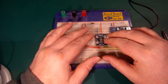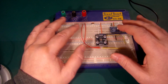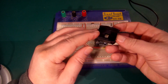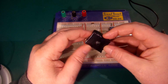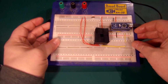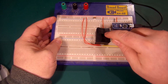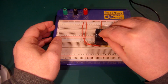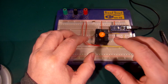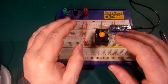Also, they're sensitive to ambient lighting, so even with these bright white LEDs, in a well-lit room or a slightly dimmer room, you can get different results. So to be a bit more consistent, I built this little shroud: a little black card, black sellotape, and a little gap in the middle, and that just slots over there. That blocks out any exterior light sources, different colours or shadows. And I've got a little narrow reading window, so I can pop the colour I'm sampling over the window, and it should only be sampling that colour. I think that's going to be suitable for a lot of projects.